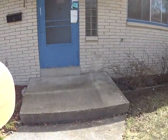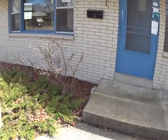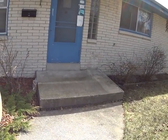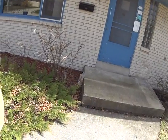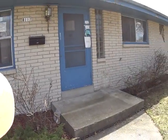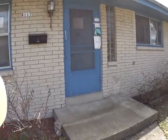This is actually starting to bow towards the house. If you can't get this jacked up, this square will probably have to be replaced, just so then it would hold upwards. Obviously it would be up, and it would actually pour away from the house like it should. So I would recommend that you would do something that way. And we have some little work that we need, tuck pointing near the entrance of the doorway.